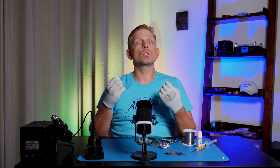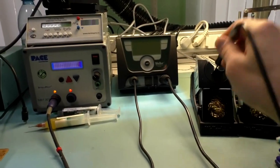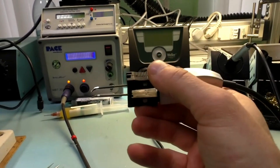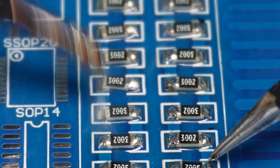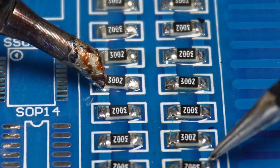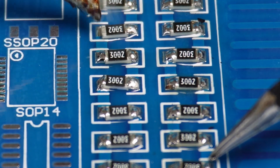Option 2: use a professional soldering station that can quickly restore heat even to a thin iron tip in real-time. Any model — JBC, Weller, Metcal, and others — handles temperature control and recovery extremely well. For most daily soldering tasks, a professional soldering station is sufficient without any extra tools. The heat compensation speed of a professional station is very high. No matter what heater is installed — inductive or resistive — you can solder a connector easily, holding the iron for just 1–2 seconds on each pin, and the temperature will stay stable throughout.